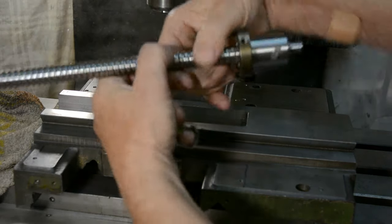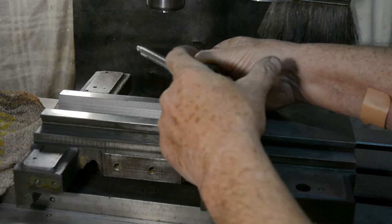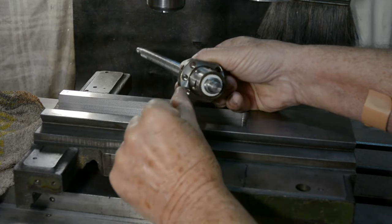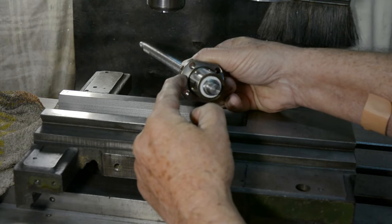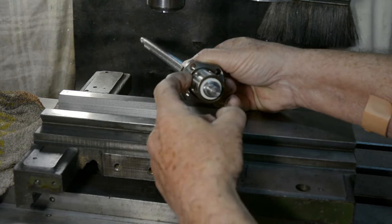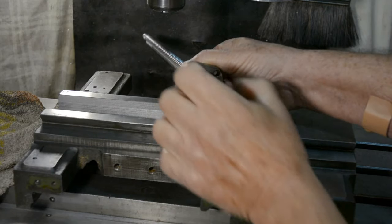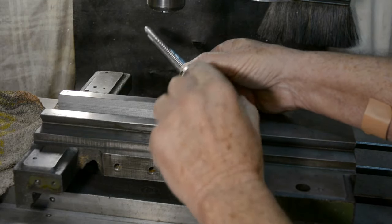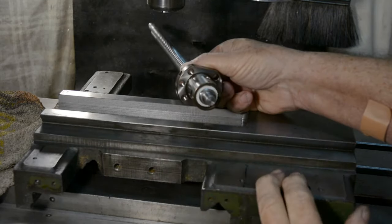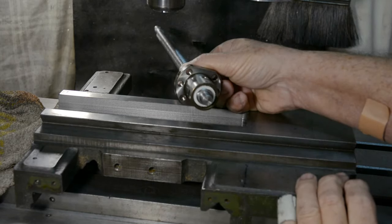So what I've got to do here is, with a grinding cutting disc, cut approximately 8 millimeters off that surface, which will bring it up close to here but not breaking into the cylindrical part which holds the balls for the ball screw. So that's the next job. I'll tape everything up, cover it in plastic so that there's no grinding debris that gets into anywhere where it shouldn't.